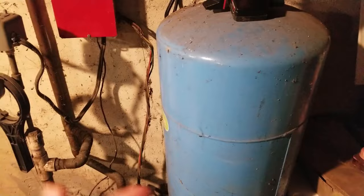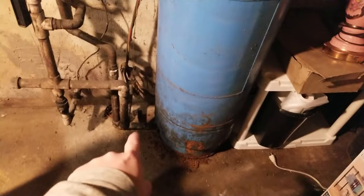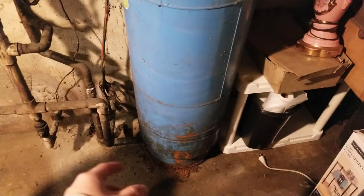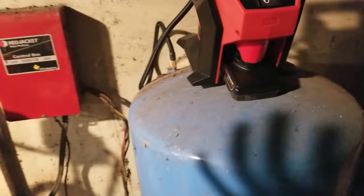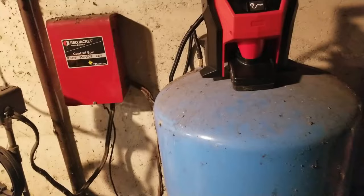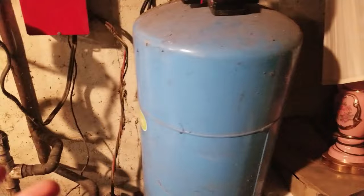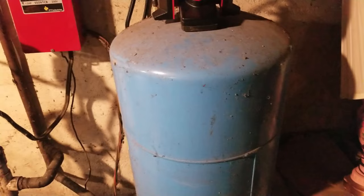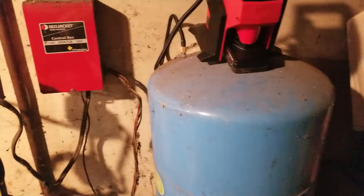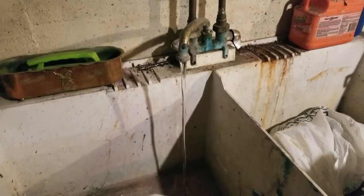For me it's new tank time. It's not that bad really, because as far as I've seen they all have the same inlet, so you shouldn't have to mess with any of your plumbing — just disconnect the old, get it out, bring in the new. I'm going to keep pumping air in with the Milwaukee until that faucet stops spitting water. Once it stops I'll close it, pump this thing back full of air. I'd like to get the same tank since it's a pretty decent brand, but it can't get here till Friday and I need water before then. We're going to hope it holds pressure well enough that the well pump isn't constantly cycling on and off, because we don't want to have to replace that.